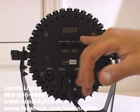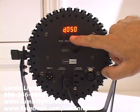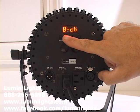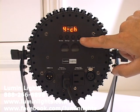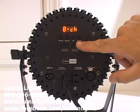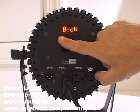If we press Mode, we see our DMX address. We can go up or down, and once you're on the channel you want, hit the Setup button again to enter. You can then see what channel mode you're in and select four-channel, six-channel, or eight-channel mode. Once selected, you don't have to hit Setup again — it's all set to go.